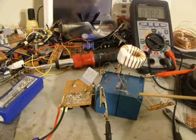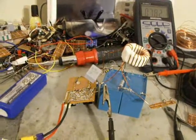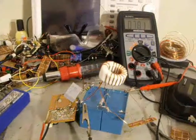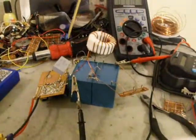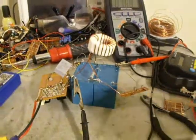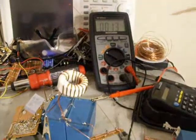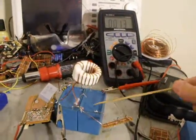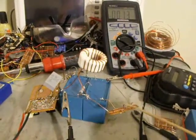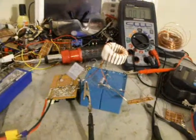The main discharge capacitor would normally have much higher capacitance, but this is just for demonstration purposes. We have 780 volts — let's disconnect the charger. The voltage stays there. Now I connect the primary of the transformer to generate the initial discharge between those two electrodes. That was loud. We have 13 volts left in the main discharge capacitor, which means the discharge actually happened between those two big electrodes. Success. Let's make a couple more shots to demonstrate that this is a reliable technology.